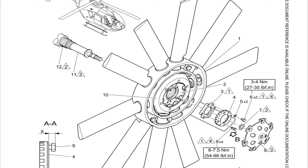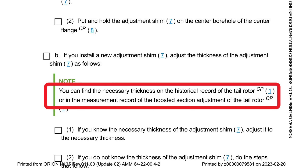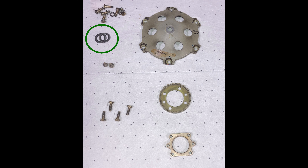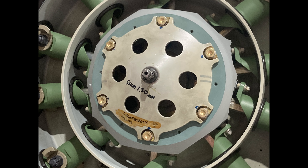When you go to take the tail rotor off, one thing you want to keep note of — and the maintenance manual tells you this — look at the shim washer stack-up, measure it, see how thick it is, and write it down. If you lose that, you're going to have to call records and get the hard card for the tail rotor. If you just got an overhauled or inspected tail rotor and it has the hard card with it, the shim stack-up is written on the hard card. If you're just taking a tail rotor off and putting the same tail rotor back on, no worries — just don't forget the shim. I've seen guys write the shim thickness on the outer flange just to make it easier.